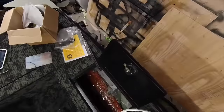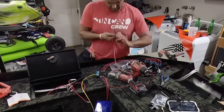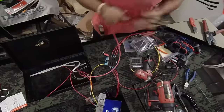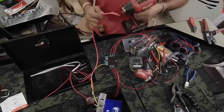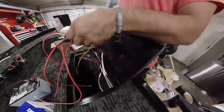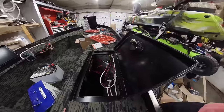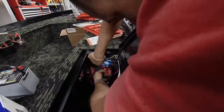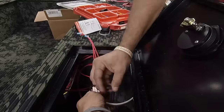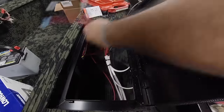This boat is fairly conservative and doesn't have a lot. That is per request of the audience, but if you're rigging up a lot of major things, you're going to need a 12-gang fuse block minimum, and sometimes 2. Then once it's all done and connected and you've got everything where it needs to go, just secure that fuse block to a wall very tactfully, so that the wires are out of the way, but you still have enough play between the fuse block and the switch panel that if you have to troubleshoot the switch panel and pull it out for any reason, you can just do that.